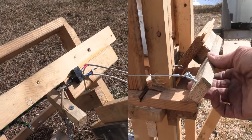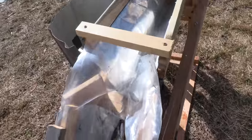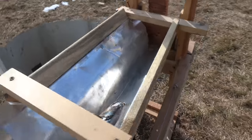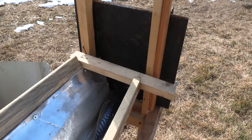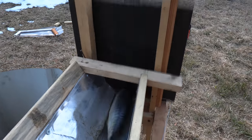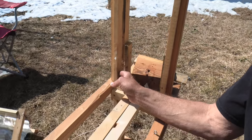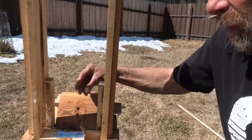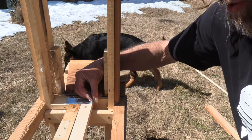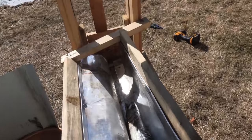I used a cable on my switch to the guillotine trigger, and then tied an elastic band to the trigger so when the guillotine pulls — or the motor pulls the fish — it's going to shut the motor off hopefully where I want it. But the motor pulled and broke again. The problem is the fish keeps getting jammed between the trough and the cross members, so I'm going to take a piece of metal here that when the trough moves will come up on a hinge and lift the fish into the trough.